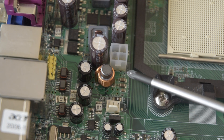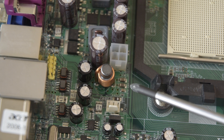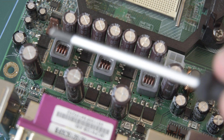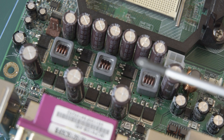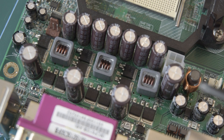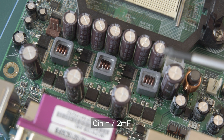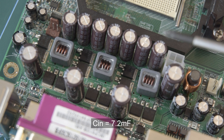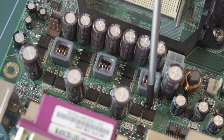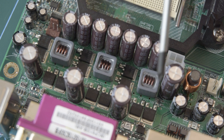The positive supply then passes through this quite nice looking inductor — due to the open-ended construction and small number of turns, I'd refer to it more as a choke than an inductor. The main purpose of this is to block high frequency switching noise from getting back into the wires and acting as an antenna, radiating into things — so for EMC, electromagnetic compatibility, basically every product is required to not mess up other products. After passing through this inductor, the positive rail continues over to here through a few fat traces, and it's stabilised by four large electrolytic capacitors rated at 16 volts, 1800 microfarads, giving a total capacitance of 7200 microfarads. Also connected to this positive rail are the high side MOSFETs — each buck converter uses a paralleled pair, giving two MOSFETs for each of the three phases.